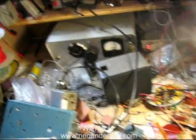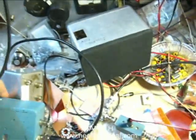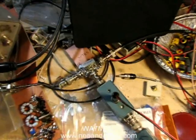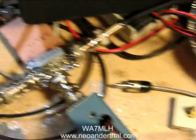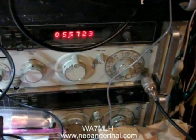In the antenna portion, there's just a cable coming in from outside going into a box full of double-tuned circuits. In this case there's a 75 meter double-tuned circuit coming in on the front end, and then a double balanced diode ring mixer which is pumped with an LO from one of my 8640B signal generators.